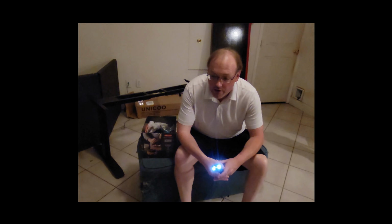I wouldn't even recommend taking this desk apart more than twice without putting some sort of glue, like wood glue, inside the holes for the screws, or thread locker, any type of RTV, something to help the wood secure, because if you keep unscrewing and screwing things in, MDF does not hold up well for that. It falls apart very quickly. If you wanted a better piece of wood, then you can go ahead and get a better piece of wood, but it's poor.